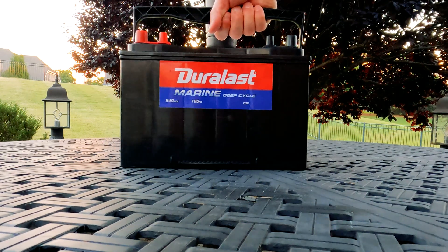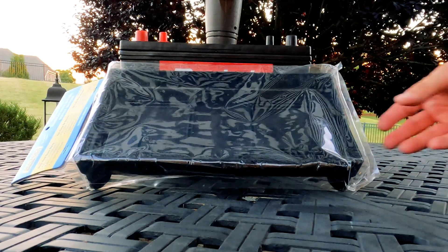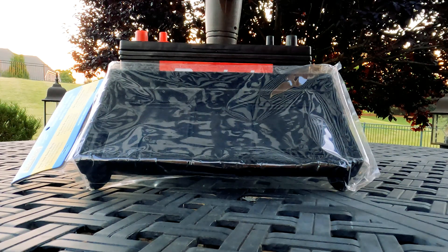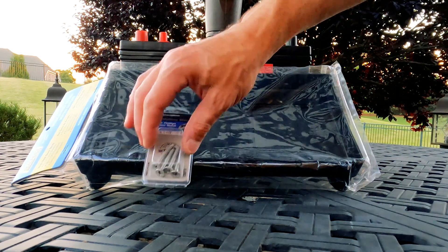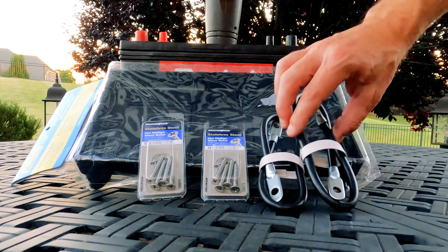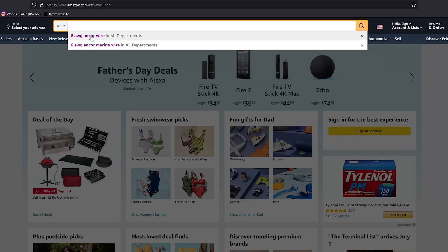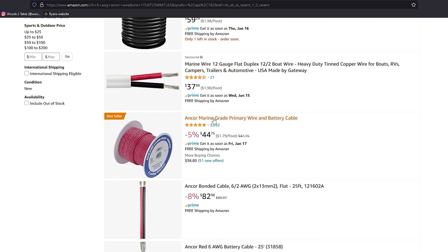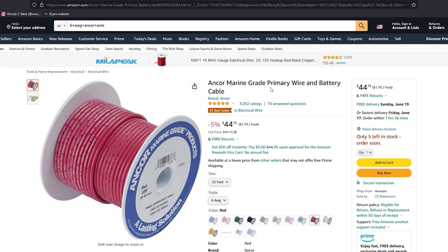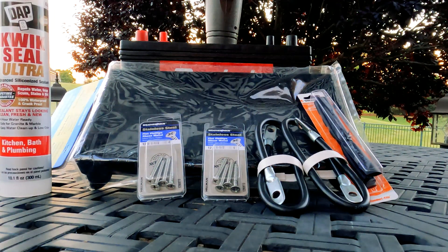You've made it this far, so you must want to add some power to your boat. Let's talk about tools, materials, and cost. You're obviously going to need batteries — for my boat I needed two 12 volt deep cycle batteries. You'll also need battery trays that are the right group size, with straps to secure the battery while the boat's bouncing around. You'll need stainless mounting hardware for each tray — don't cheap out on this. Marine grade wire and lugs that fit your battery posts are important too. To give you an idea, 25 feet of six AWG anchor wire is $44 on Amazon. Shrink tubing to make the connections extra waterproof, and some silicone to fill the screw holes for the battery trays.